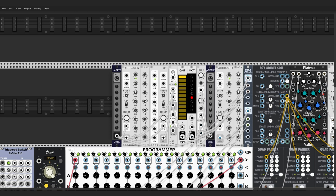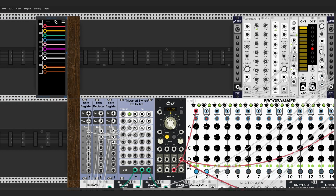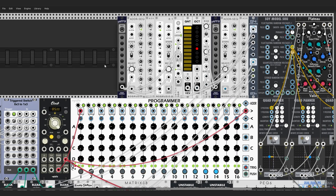In the external mode, the fader value addresses the sequential switch. We just need to patch the poly CV output of the sequencer to address the input of the switch and the output of the switch back into the circuit. We now have a button that switches between the value of the knob and one of the four external CVs controlled by this same knob.